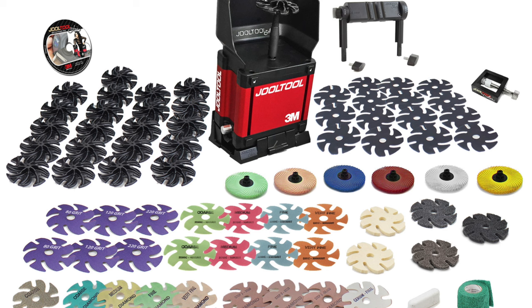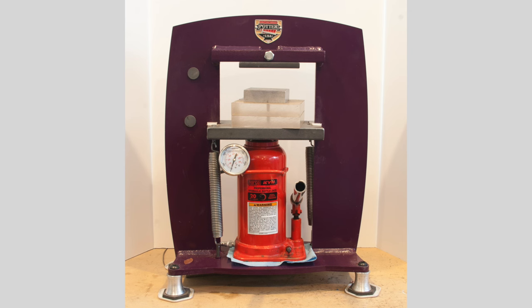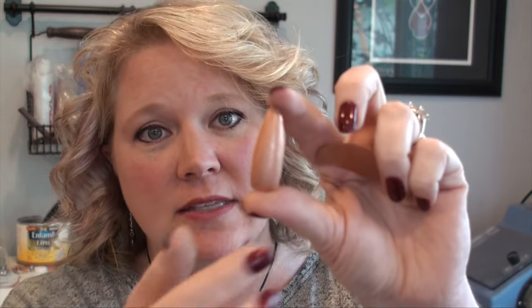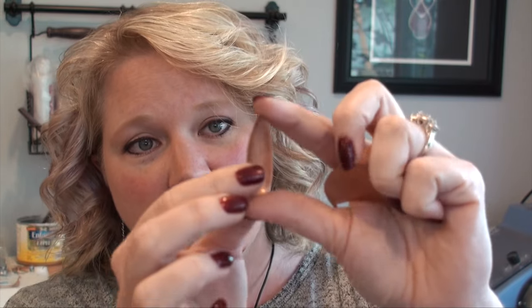One of the things that I really like to do is use my hydraulic press to create hollow forms, but there's multiple steps in that depending on what it is that I'm doing. In this case, I actually have a piece that I'm working on — I have textured up one of my copper pieces that's going to be flat. This is going to become my back plate, and then I also have a piece that I have domed here. I've just taken and roughly cut this out with a jeweler's saw.